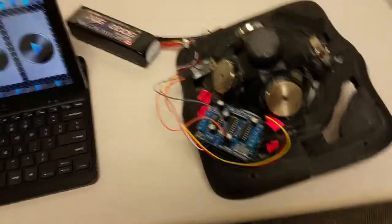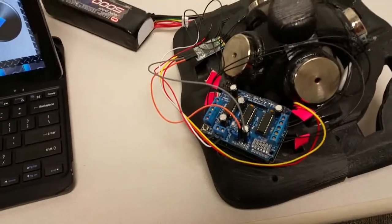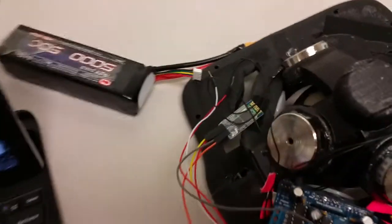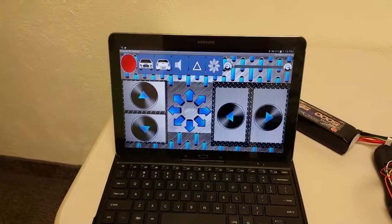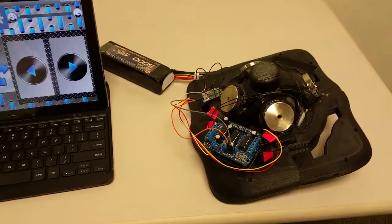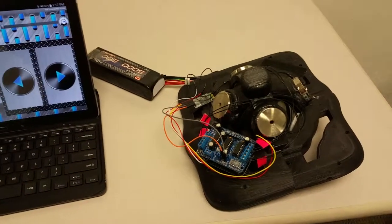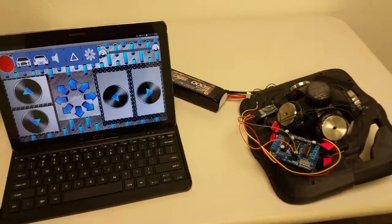Now to program and run our project, we used an Arduino Uno, a motor shield that would drive each of the 4 magnets, as well as a Bluetooth receiver right here, which we then connect with this application here, as you saw DJ running it, going up, down, left, and right. You can also program the Arduino to run it automatically, which is huge and awesome, but we decided to use this Bluetooth application to be able to control it ourselves.